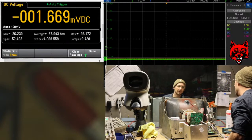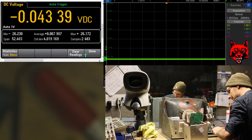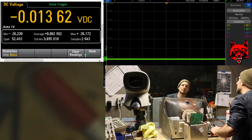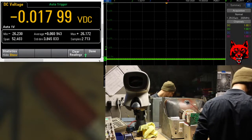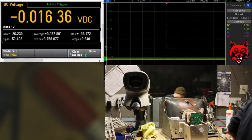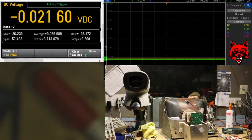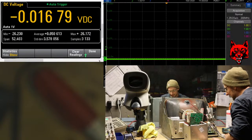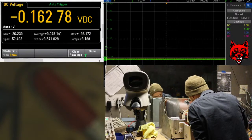And it's missing a quarter, or half the screen, I should say, not a quarter. That would do it, huh? But why? Is it the deflection transistors yet? Because I don't know. They meter good.